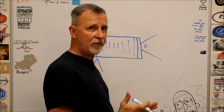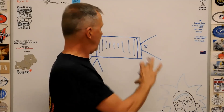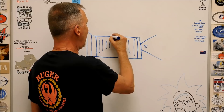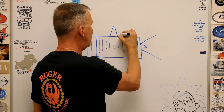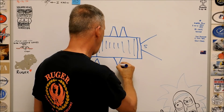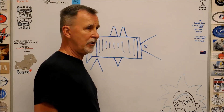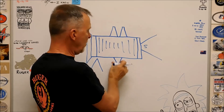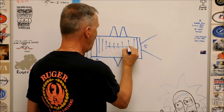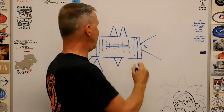Let's say you run that through all the way to completion and you have a thread. When you check that thread, pitch diameter is there, stock diameter is there, all is well. What next? You look for the thread profile from side to side. If one side of this thread has a nice flat on the crest of the thread and the other side is sharp, you're going to know that this side cut more than that side — because the deeper you go, the sharper it gets. This tells you that the material centerline is not collinear with the helix. There's your error right there.